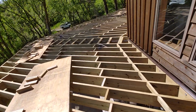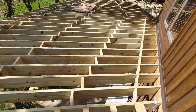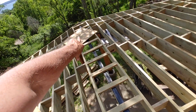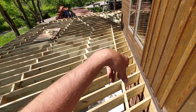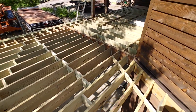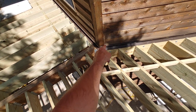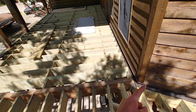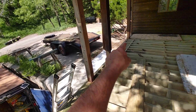This whole deck has a triple border — three boards that go around the entire perimeter, and also right here in the middle it goes up. All of the points are going to be herringbone, so it's a pretty nice look. What I mean is there's not going to be a big miter — a lot of people put a huge miter, but we're going to do herringbone. There's another staircase over here that's ten feet wide from post to post.